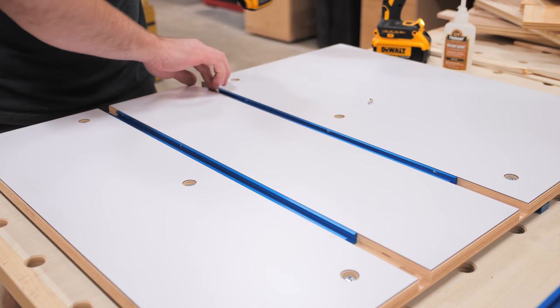I had specifically bought a set of feeler gauges just for this build so I figured I'd put them to use and try to get the fence even more accurate. I clamped a piece of scrap wood in front of the fence since I needed to move the fence forwards, placed the feeler gauge matching the distance I needed to move between the scrap block and the fence, then removed the screw, moved the fence against the scrap block, clamped it down, and drilled a new screw hole — critical, as driving back into the previous hole would just return the fence to its previous position. After readjusting I repeated the five cut method and ended up with an error of roughly one thousandth of an inch per foot, which is plenty square for anything I'll be building.